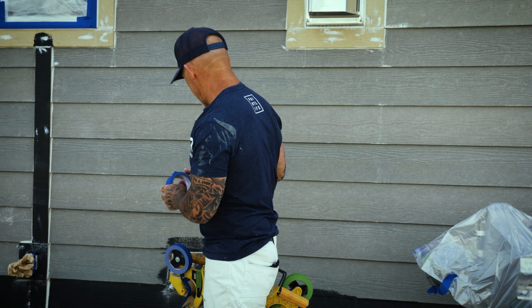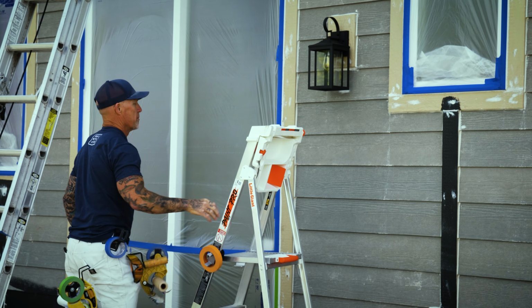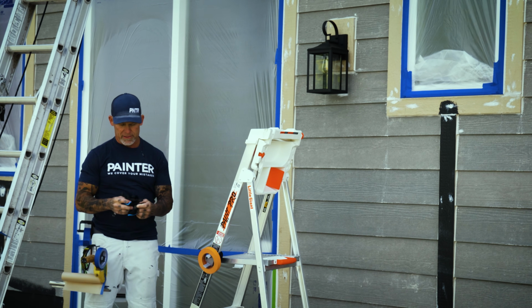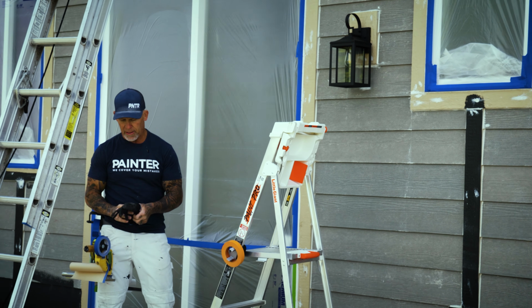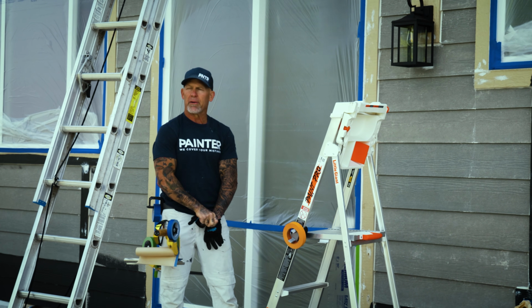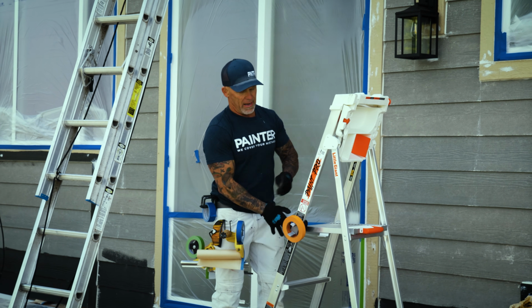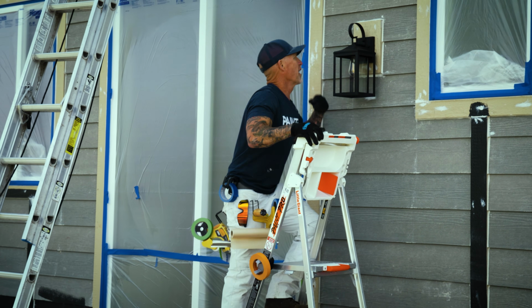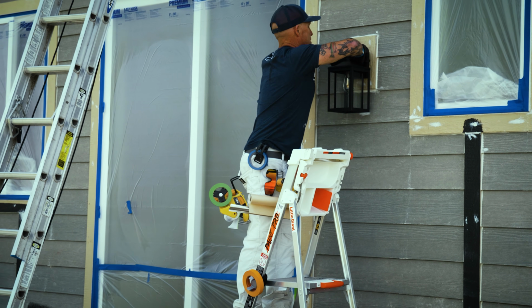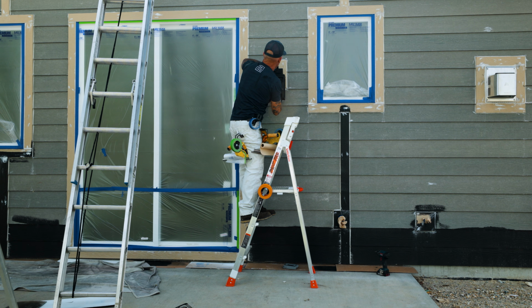So I have a water spigot. I do have a light. So if I've got light fixtures, I'll show you. When it comes to a light fixture or any type of electrical device, I typically wear gloves. You want to go in, shut the light off, turn it on and off, make sure the power's off. Even when the switch is off, I like to wear gloves just as an assurance that I'm not going to get shocked. Now, most lights, we've got two screws or two nuts, not screws. These two nuts will come off. This is probably one of your stereotypical lights.